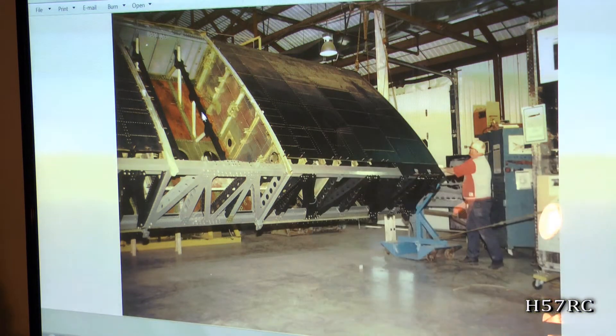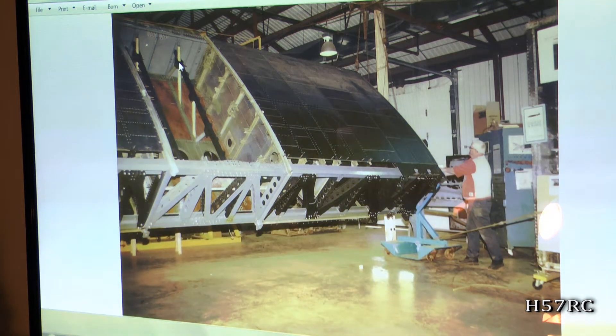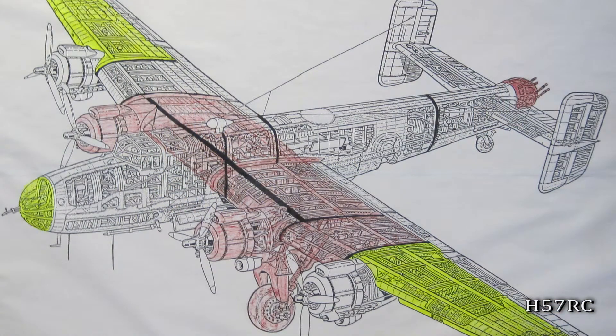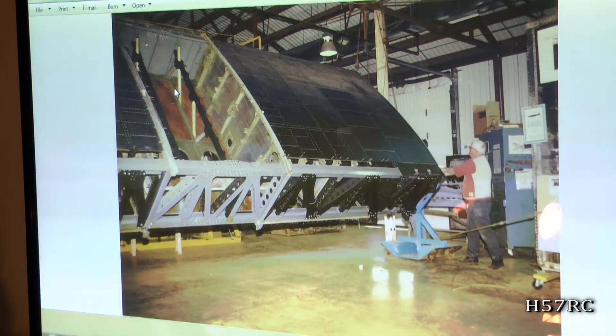This is where I said is the crew rest area for takeoff and landing. The seats are not put in yet, but as you can see, it's almost like a race car roll cage — very, very highly stressed. You can see the tubes and the triangulation, and how heavy these upright supports are. Some of the control cables would run through here underneath the seats and go out through the back through fair leads.